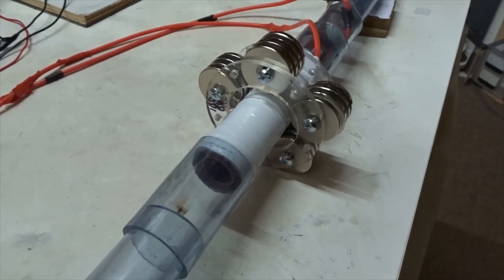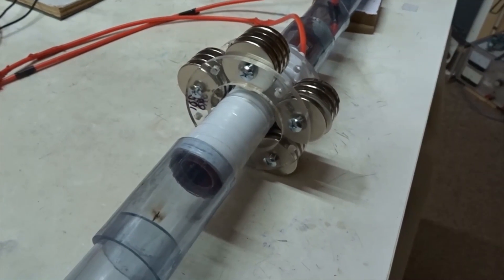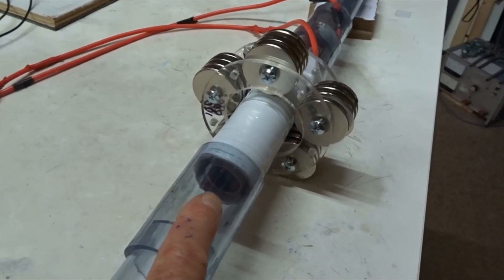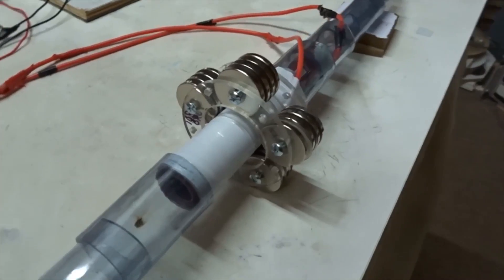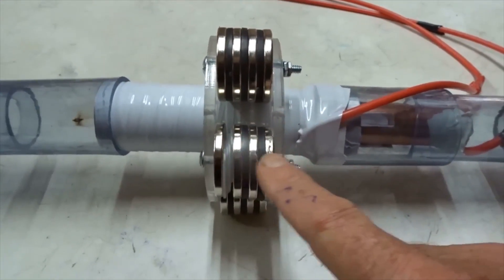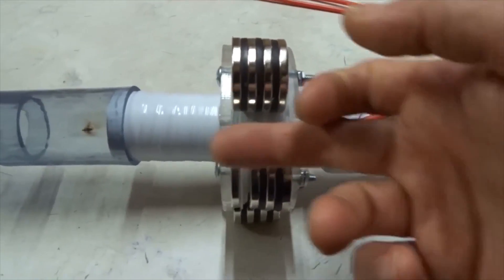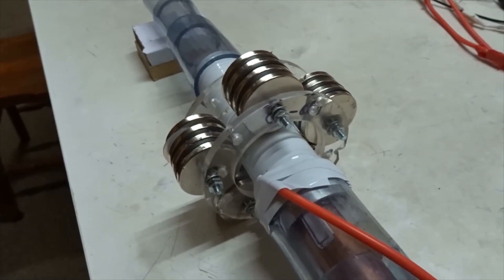There is also another type of model which might be easier and more versatile to use than radial bar magnets: stacks of permanent magnets or wire coils with DC power, placed in a ring around the aluminum and copper tubes. This acts like a ring magnet, creating a big axial north pole down the length of the tube, which makes the ions spin. These magnets also have a finite thickness, so there will be a radial magnetic field along that thickness of about 25 millimeters. As the ions spin, there will be a Lorentz force from the radial field that will shoot the ions outward.